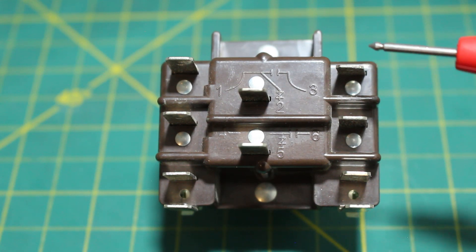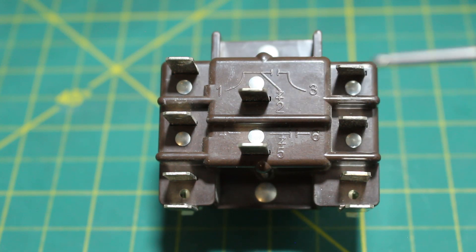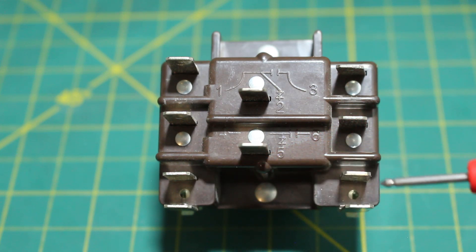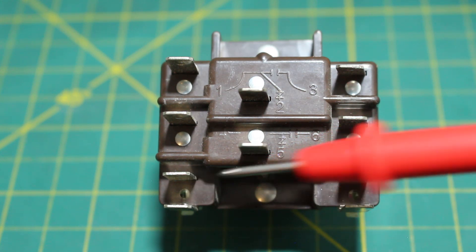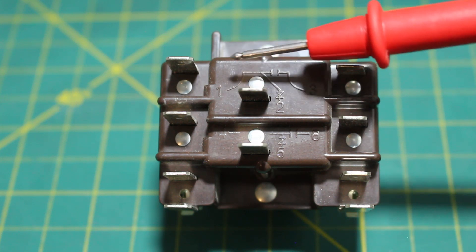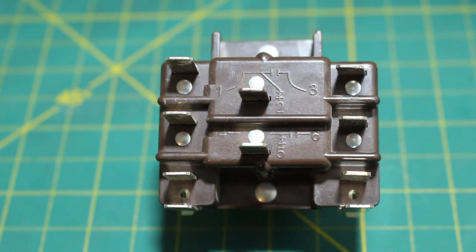If we are facing our relay face up, you can see the numbers as you would typically read them — they're not backwards. When looking at the relay in this position, your coil is always going to be on the bottom. These two points and these two points are the coil. One thing you'll notice is that the coil is the only thing not actually labeled on the relay. The contacts are labeled 1, 2, 3, 4, 5, and 6, but the coil is not labeled. In this case, you can physically see it, and by theory you will know. I recommend looking at a diagram.